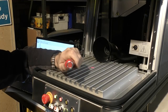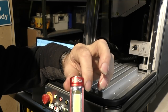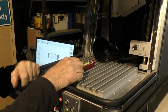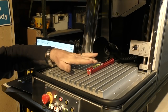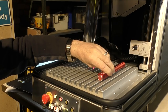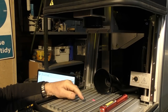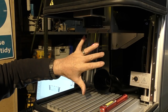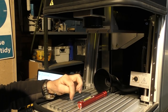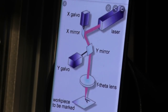This is a high-volume production marking machine. Here's a product where the red anodized aluminium has been removed with a fiber laser — probably every three seconds another product is offered in front of the laser. The great advantage of this machine is it can mark non-flat products, because the lens is about 12 inches above the work surface, giving it an incredibly long focal length with quite a wide focal range, so it can easily work over a curved surface like this.